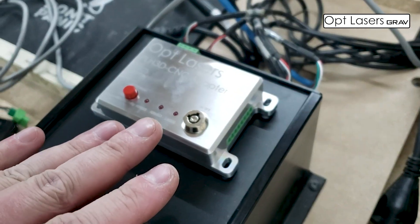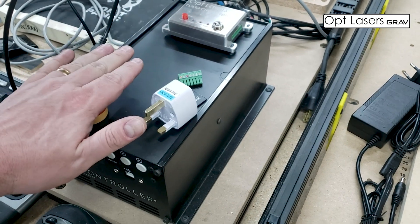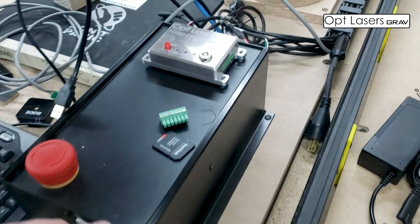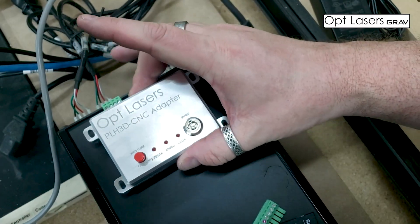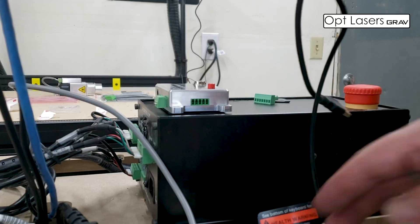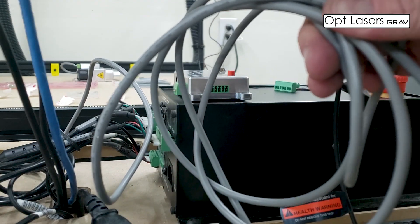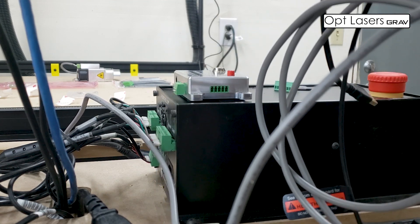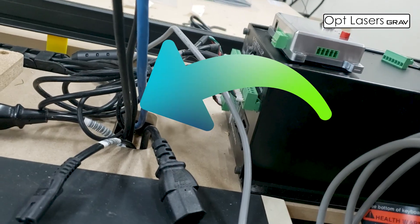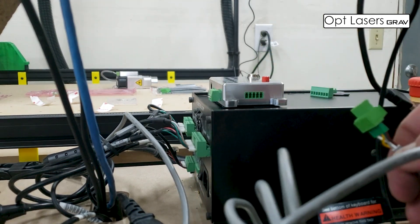So this is where I'm going to put my Optlaser controller — just right on top of the X-Carve X controller, so that way everything as far as control and lockout is all right here. I've put Velcro on the back, so I'm just going to take these off. The next step is to take this wiring and stick it in there — the only way you can do that is just push it in. You've got all this extra cable, so you're going to want to figure out where to put that before you push it down, because you've got to tuck it away. I'm going to tuck mine down in that little hole there and feed it back underneath here, so I've got enough space without cramping it.